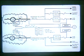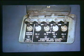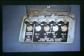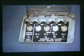These circuit breakers, called phase breakers — one for A phase and one for C phase — protect the inverter output in case of a short or malfunction. There are four phase breakers on the throttle lock relay box, two for each inverter. The throttle lock relay box is located to the left and behind the captain's seat on the bulkhead. Four circuit breakers protect the A and C phase output of the upper and lower inverters; the fifth circuit breaker is for the emergency instrument lights.